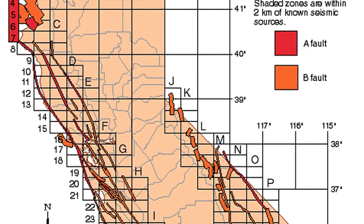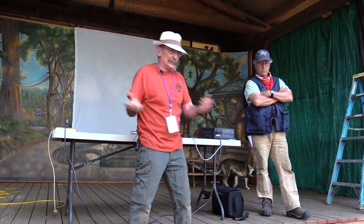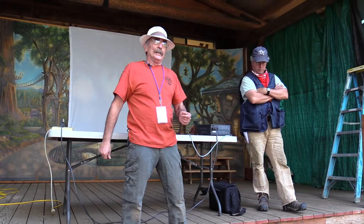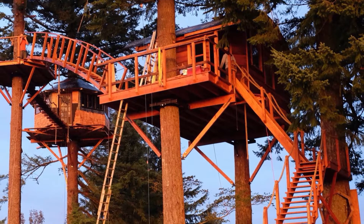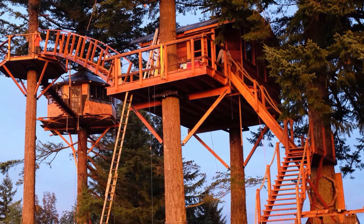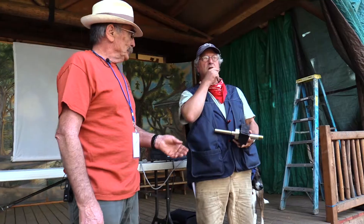In California we inquired about permits before. Seismic — I'm not too worried about with trees because it's horizontal loading, a back-and-forth thing. That's what a sliding bracket is for. The only place we've really had failures has been where we've had cyclical horizontal loading due to wind. The higher up you go, the more leverage you're going to have, the more movement you're going to have. That's one of the restrictions to treehouses. One of the rules of thumb: the higher up you go, the smaller you make it.